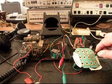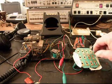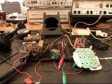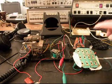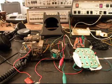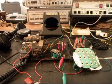and this light here was original to the phone. It would come on and you could see the light, the LED, but it really didn't have much function. When you go through your pulses, the light might have flickered a little bit, but when you're in a touch-tone mode, there's no pulses to go by. It's more of a sine wave and a frequency. So what really happens here is the light just stays bright. It's an indicator that you're on the phone.